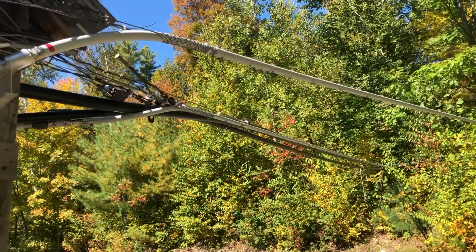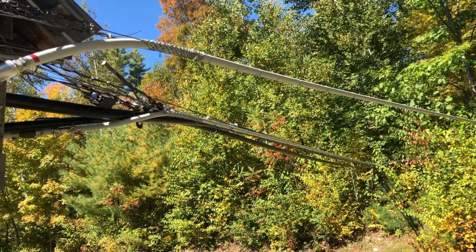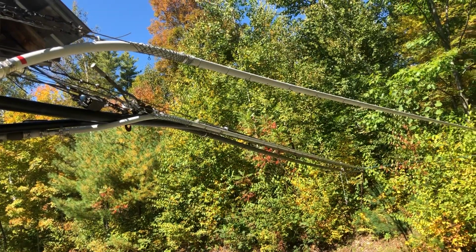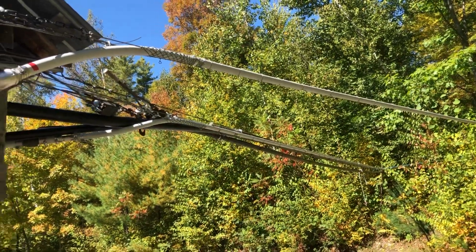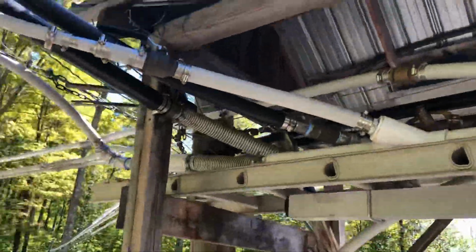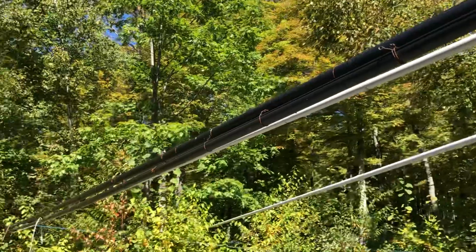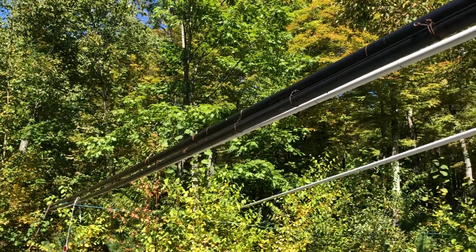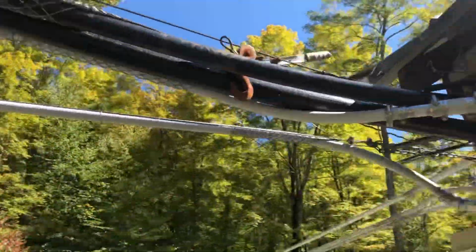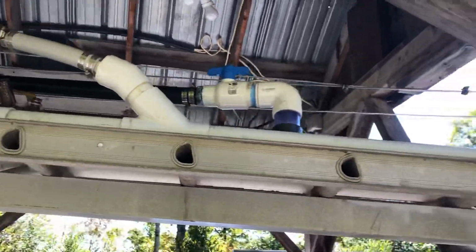If you're going to get over 500 taps, let's say upwards to 1,500, then I would suggest a wet-dry system, at least 1 inch. You could even do 1 inch over 3/4 if you wanted to. That works also for that size. Maybe 1,000, 1,500, I would probably do just 1 inch, but 1 inch over 3/4 could work also.